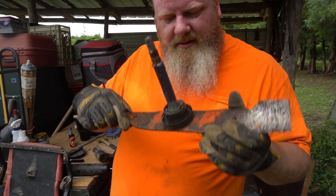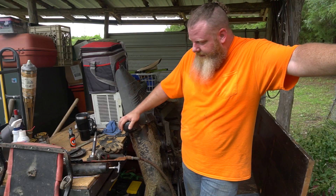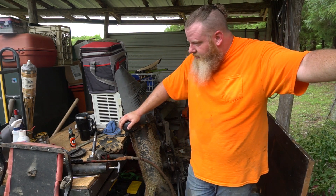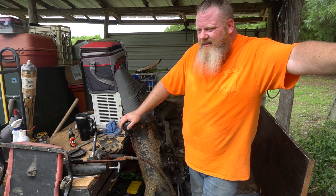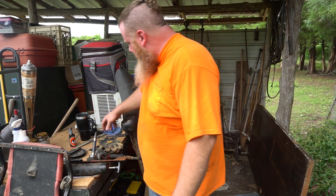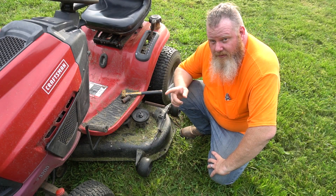This is ridiculous, no wonder why it was so hard to grease. I grease this about every two times I mow — I'll just reach in there and put about three or four squirts of grease in them and it's always really hard. I think possibly the grease fittings were painted shut. Paint will clog a grease fitting. Pro tip.